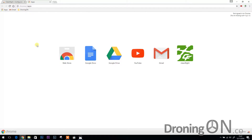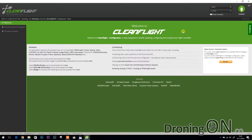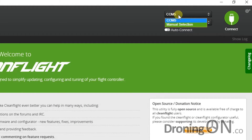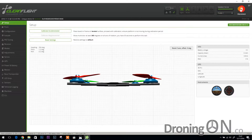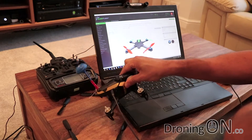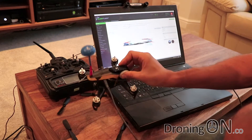Click on the CleanFlight icon with your USB cable connected to your Rodeo, then maximize it — we're now in the CleanFlight interface. Up at the top you'll see that a port has automatically been found; that's the port assigned to our Rodeo 150. If you don't have that port or it still says manual selection, your Rodeo probably hasn't installed properly. With the port selected, click 'Connect.' You can see that if I move my aircraft around, the real-time representation of the flight controller is shown on screen.